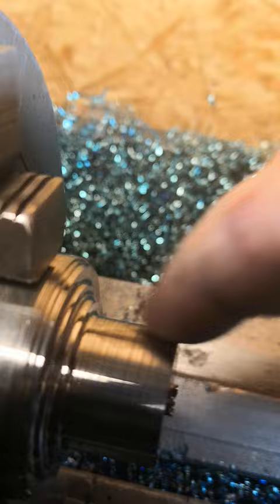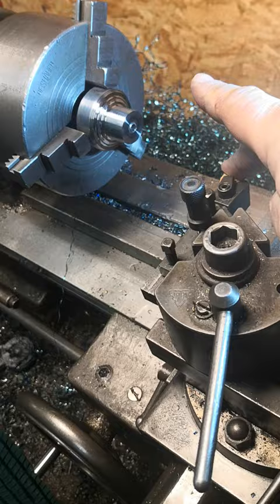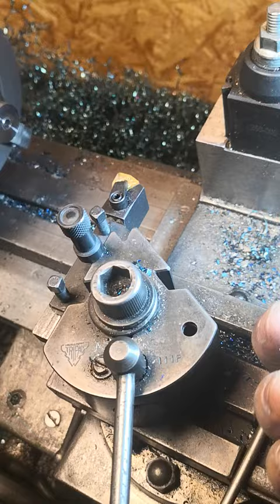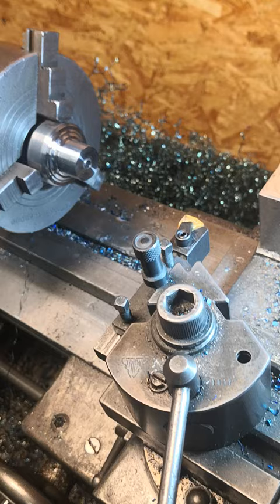This surface will become flat and nice too — this is 30mm but it turns really great for what it is. This Toolox 44 is somewhat too hard on my carbide inserts. The inside turning is really difficult because of chatter — I don't have a good tool for inside cutting. I don't make 100 of these; I make three, and all have this chatter inside, but it's not that bad for what they are intended for.